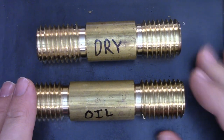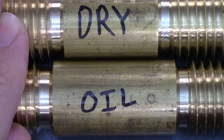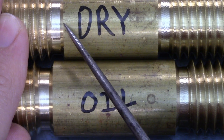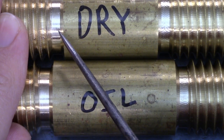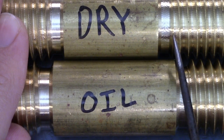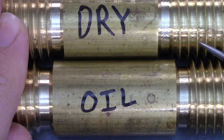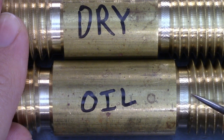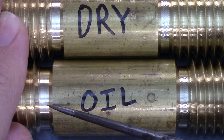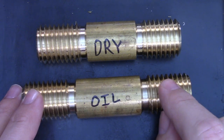The most likely cause is that brass is a material that machines best at high speeds, and since the thread was so coarse I was running my lathe at its slowest RPM. A good indicator of this is the thread reliefs on the two samples, all cut using the threading tool. I cut the first one at high speed before putting my lathe in back gear for threading and it looks quite nice. However when I flipped the piece around for the cross feed side, I didn't bother changing speeds and just plunged in at 50 RPM — that surface is torn and chattery. With that in mind I made sure to go back to high speed to cut the last relief and it looks great as well. Perhaps my choice of material was actually misguided, but this brings up an excellent follow-up idea where I'll test the same thread at various RPMs to see if that makes a difference.